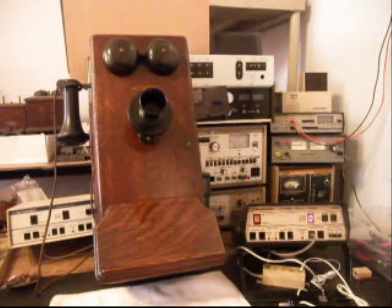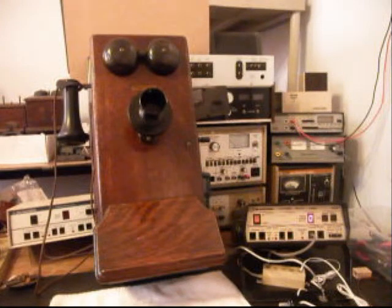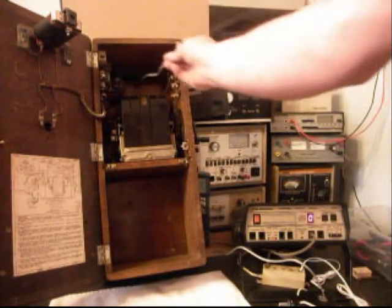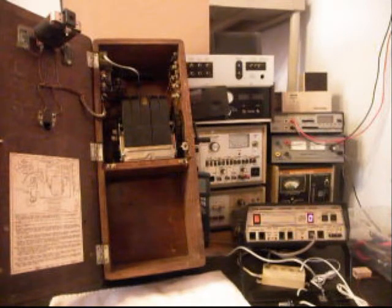We also went through the solenoid — oiled it, checked and adjusted some things — as well as the magneto and the wiring. We rewired some of the wiring so we want this telephone to work the way we want it to work. We also installed a circuit that allows you to crank the magneto and ring the bells but not back feed any voltage into the telephone line, and when you get a call that comes in your original bells will ring. Richard has his spit cup — we just put a shop spit cup on there for the video. We also have a line modular port so all Richard has to do is bring his line cord in, plug it right in, any length, any color — makes for a plug and play, easy, simple connection.